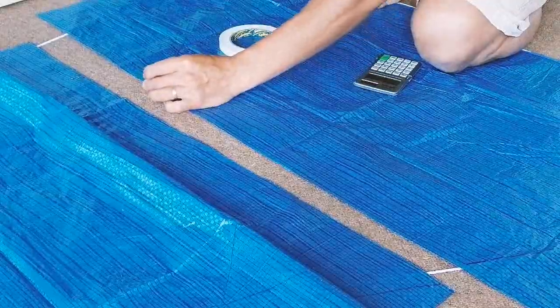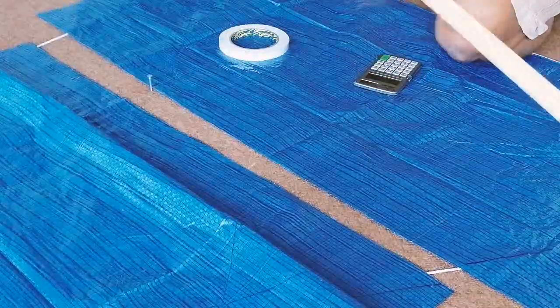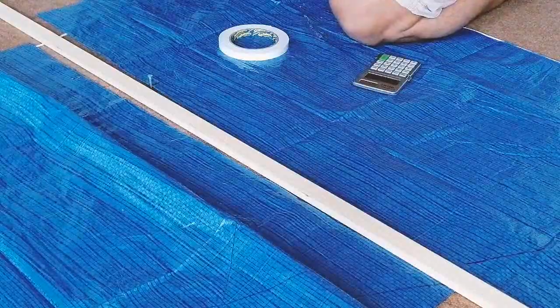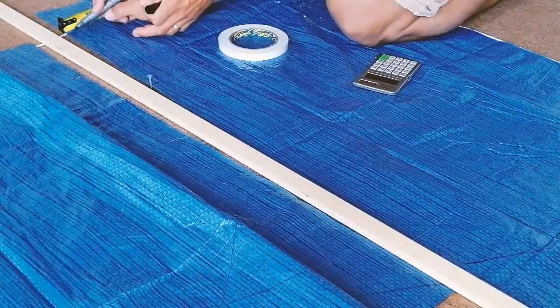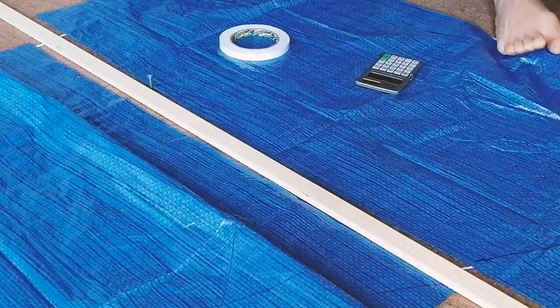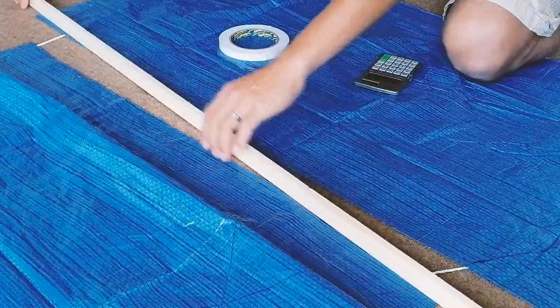mark the nail on the 30% point of the length, use a batten. See, batten is flexible. We want to make a curve. I'm going to drop the curve at about 1 centimeter. You can go deeper, but I would suggest you go a little bit shallower. Try first. If you go too deep, you won't get a good form of the good shape of the sail.